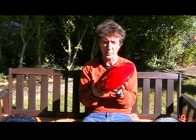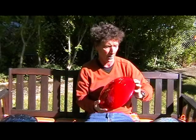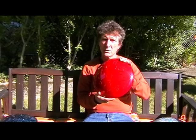This is a powder coat paint applied in two coats. It's a really complicated process — normally you paint a coat, let it dry, then put the next coat on. But with this one it's unique: we put on a coat of powder and bake it just until the coat gets kind of a jelly consistency, then bring it back out and do another coat. The second coat reacts with the first one chemically and they bond together. That's how we get the nice color-changing properties and the metallic look, and it's more durable with two coats instead of just one.